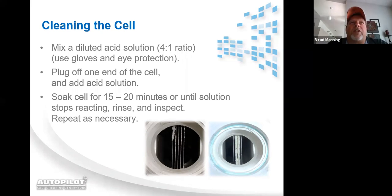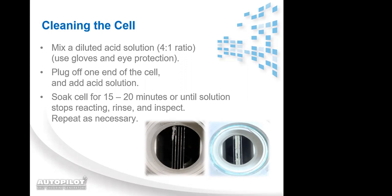I've literally seen a homeowner that used rock salt because his chlorine was low in his pool. So he activated the boost button, and then the water literally had a black tinge to it coming out of the returns, and then eventually his whole pool had a black tinge to it, because basically the cell was rusting the iron and burning up the iron that was in the water. So there's a lot of impurities. That's really the only reason. Any type of salt will create chlorine.